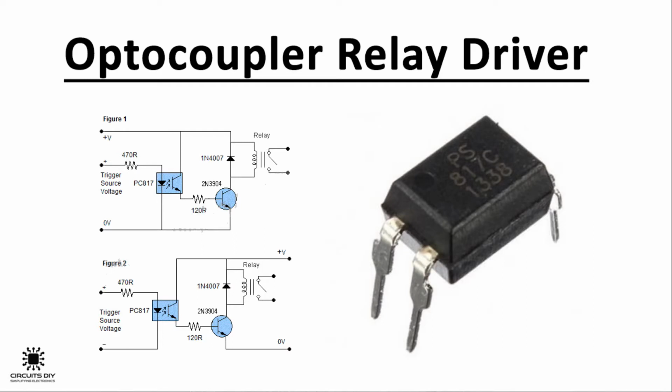And you won't want to connect this directly up to your circuit. You will definitely want to use an opto isolator. So basically all that is, you put in a small voltage to power the LED inside of the opto isolator, and then that connects to other pins and it's isolated, but it's solid state. That's what makes it different than a relay. And they're exceedingly cheap.